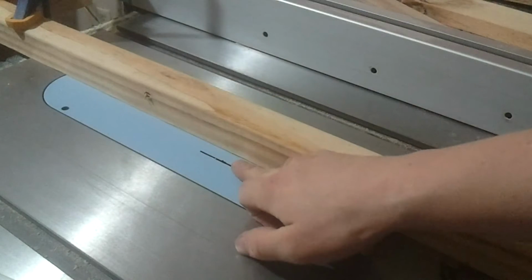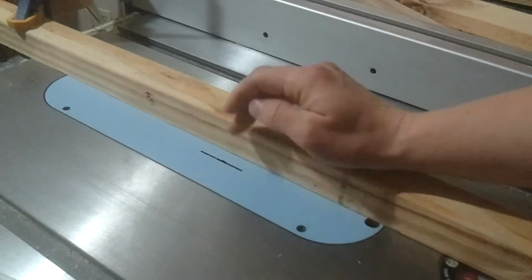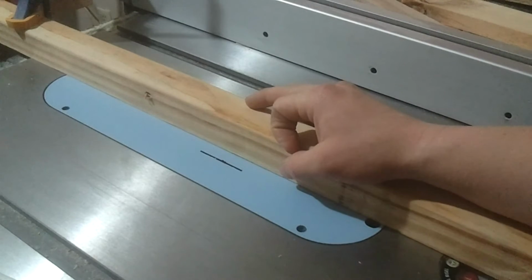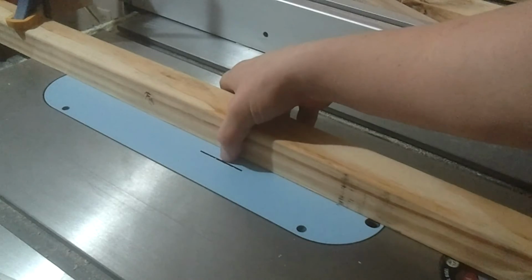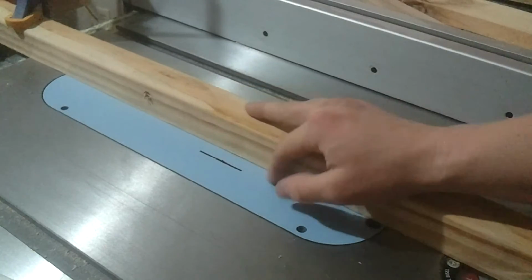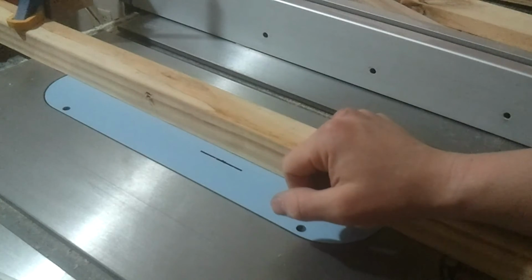The cut was started with my circular saw blade, and I've put a 10-inch blade back in there. However, the lowest depth of this Porter Cable saw still has the teeth touching this zero clearance insert. I've actually got just a tad bit of tear out on this melamine surface from where I tried to push this down, and that was actually in the way. I thought I had enough clearance, but my sawtooth was in the way. I just spun it up real quick in place, and it spun fine, so whatever was in the way has been removed by the blade.